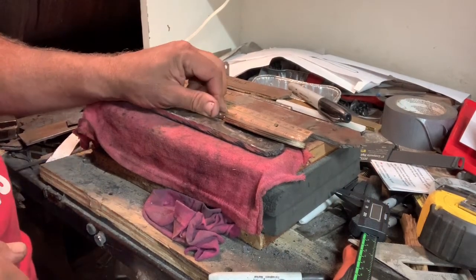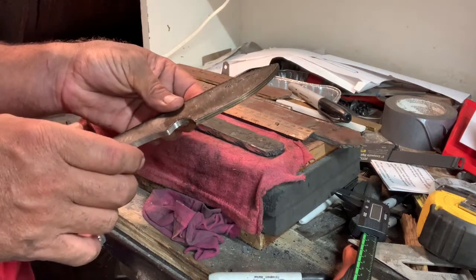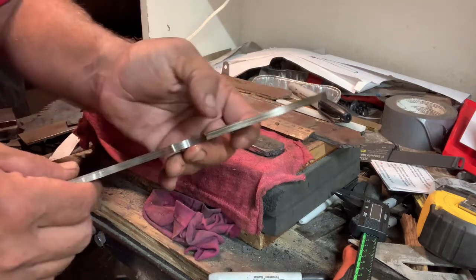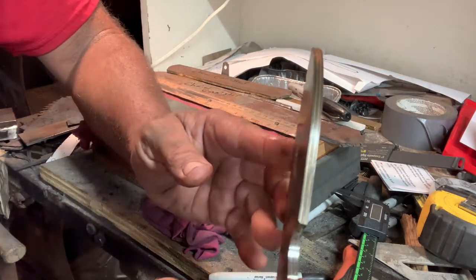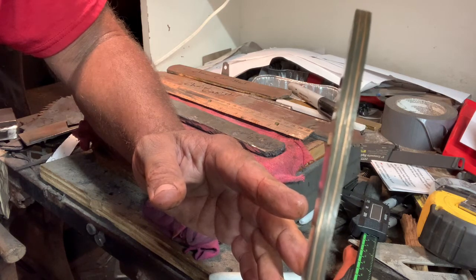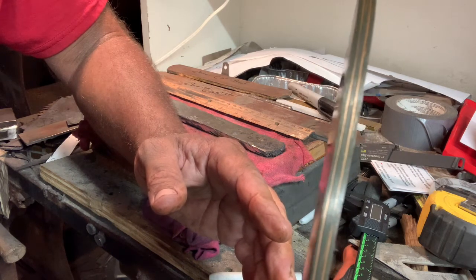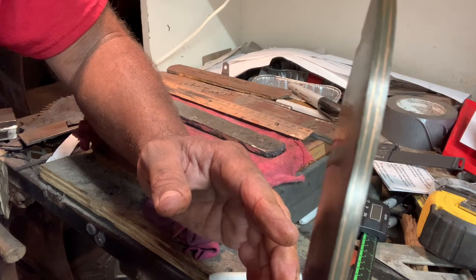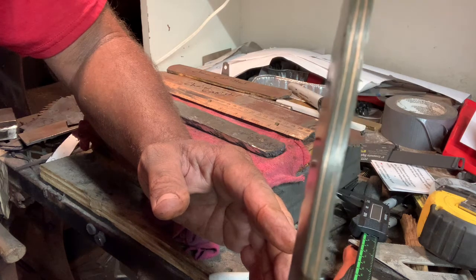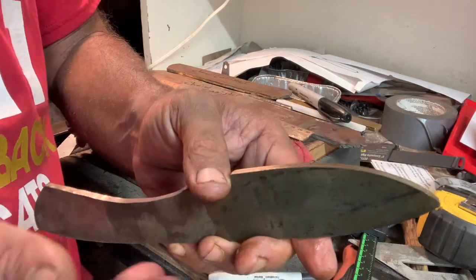First thing you'll notice — not a funky dagger shape. I ended up having to cut the ends off and didn't have a wide enough piece to do the dagger, so I ended up just doing a skinner. If you look real close, you might be able to see it — you can see the copper, a little bit of Damascus on the outside, copper, and then the 1084 core. I think it's going to work. I'll put some grinds on it and show a little bit of that. So far, mild success.